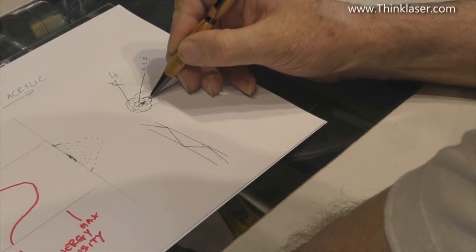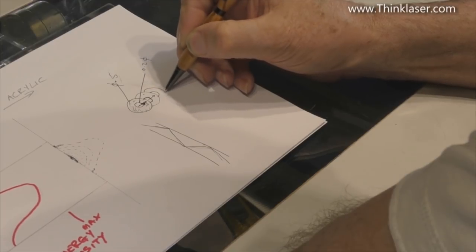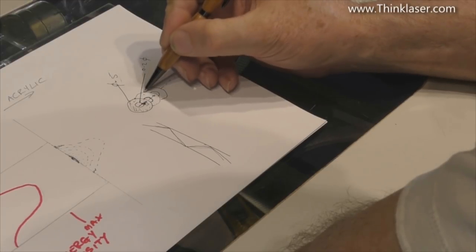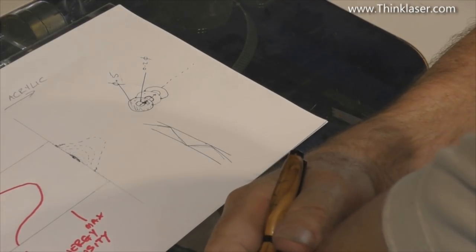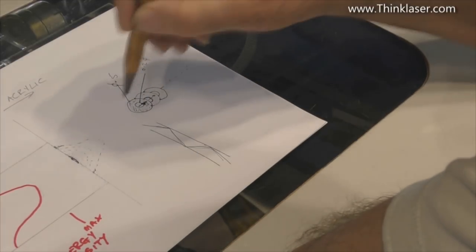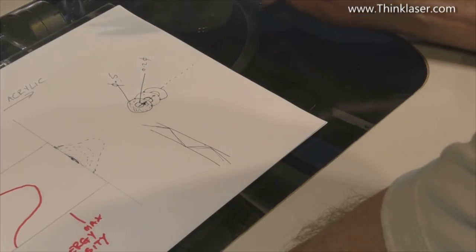Going from 0.2 to 0.5mm leaves me with the impression that there is no solid material here for the laser beam to react with. The laser beam has to react with a clean solid surface - it has to excite atoms. If all we've got is a gas cloud, it might excite the gas cloud but it's not removing material from the edge of the solid block. When the laser beam moves forward, nothing happens until the high-powered central part of the beam starts to engage with solid material again. At that point we start generating another cloud - and these nodes are what I'm proposing are the striations.